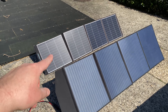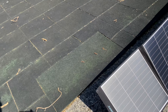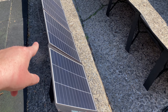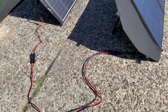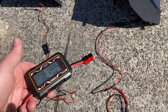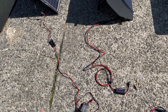The last one is the SP035 — very interesting. Look at the size difference: both are 200-watt panels but this one is noticeably larger physically. Build quality is actually decent; I like the compact size. When I tested it before it was getting 150 watts. The open circuit voltage on the SP035 is about 22-23.5 volts. No shade falling on any of them, so let's connect each one and see what power each produces.